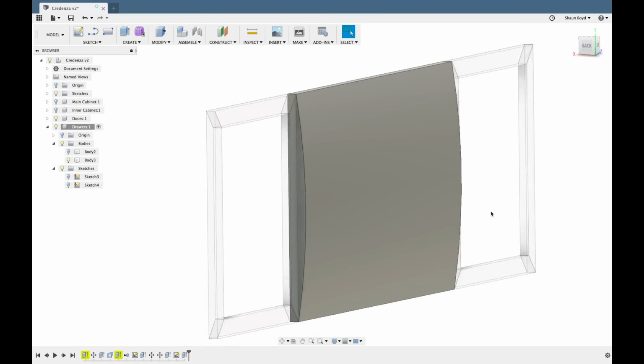After that, I got started on the center drawer fronts. I glued up a panel of 8/4 white oak that spanned the height of both the drawers, as I figured it would be easier to shape the curve with the panel in one piece.